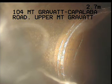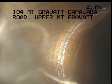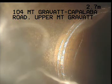Okay, so I'll just work my way back around that bend, and it does look like it was on a join where that root intrusion had occurred. So I'm just going to work back and then work in, and it looks like it was on this joint here. As I say, this is under grass next to the old disconnected septic, so we would probably need to hand dig. We could excavate that and cut out the root intruded section of pipe.